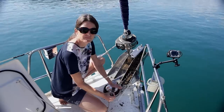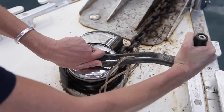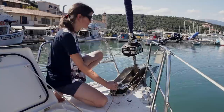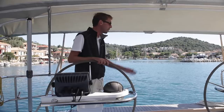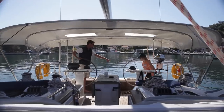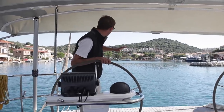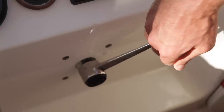Skipper Mike Skeet talks us through the final approach. He calls for stage one — the anchor needs to go one metre under the waterline. With a thumbs up from Amanda confirming stage one, they begin the approach. The wind is coming across the windward side of the boat; as the wind increases, they increase speed. With no wind in a completely flat, calm situation, the whole manoeuvre can be done in tick-over reverse.